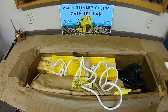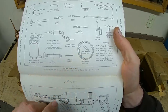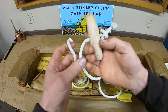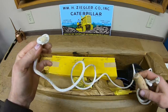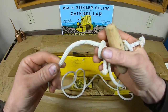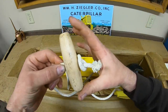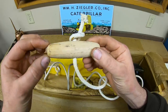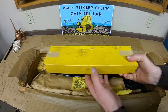Next up is the starting rope with the wooden handle — you wrap it around the flywheel for the starting engine. Referencing the book: 3B3808 rope starting and 3B3809 handle starting rope. The rope itself from the knot to the handle is 80 inches long, about 5/16ths woven rope, similar to clothesline rope. The handle is four inches wide, inch and an eighth maximum diameter in the center, tapering to three quarters of an inch at each end.